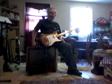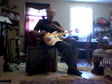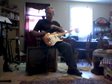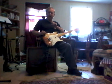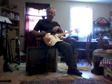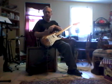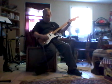This is a low gain amp. It has 2 12AX7s, but only 3 of the 4 amplifiers are being used. So you could go in and modify the circuit and add a first stage in front of the existing stage and make it more high gain. But I tell you what, if you just hit this thing with a little bit of overdrive, it really starts going crazy. And it has so much bass on the bottom. In fact, if I make this thing bassy, turn the bass all the way down.